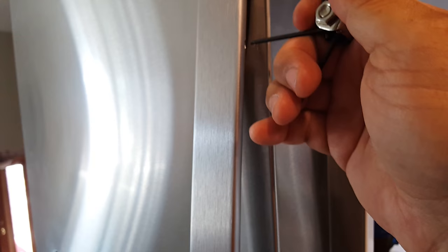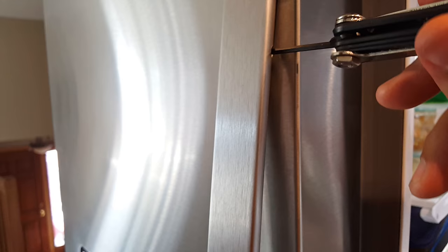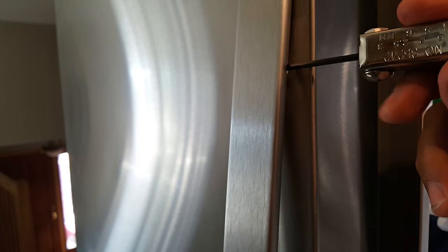There are different sizes — the one I was just using, I did that on purpose to show you that you might think it's turning but it's the wrong size; it's too small. This one is definitely turning — look at that, starting to tighten up. You want to go about as tight as you can without wrenching on it too hard. You don't want to strip that head of that screw inside there, and that's all it really is — a threaded screw that tightens down against a grommet inside of that handle.